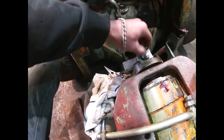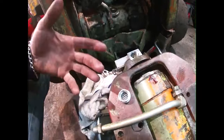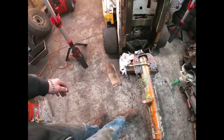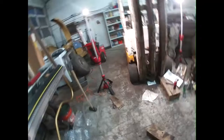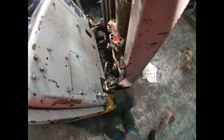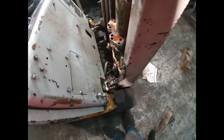No big deal - I got the parts, I'm making it happen. We've got the eight bolts for this mount here, four up top for the top section, and then just two lines and it's in. Then we've got to slam the chains back in and the back cage, and we're good to go. Alright everybody, the cylinder is installed. I just finished hooking up the two lines in the back, tightening them down, got the two anti-rotation bolts in at the bottom so it doesn't spin around, got the back locked in, and the upper floor locked in.